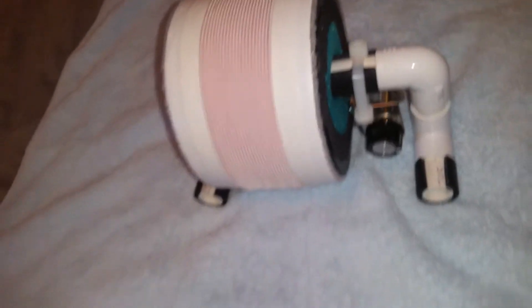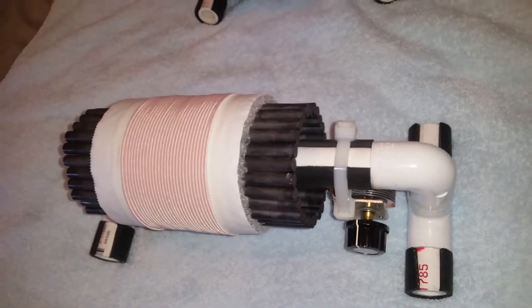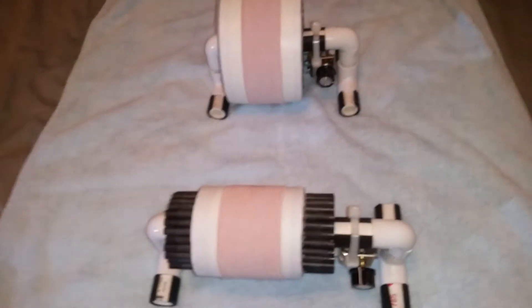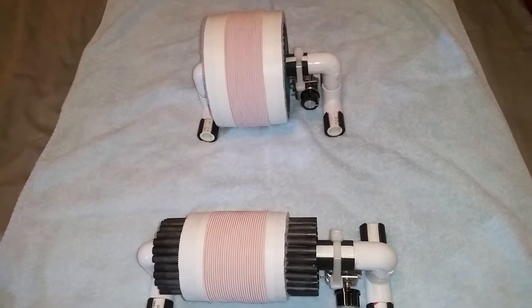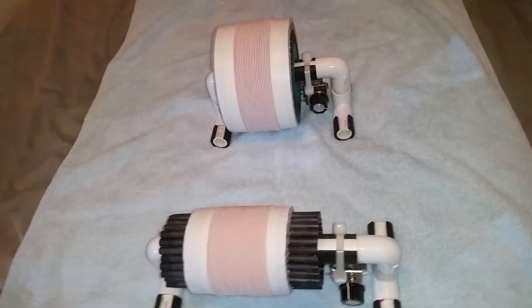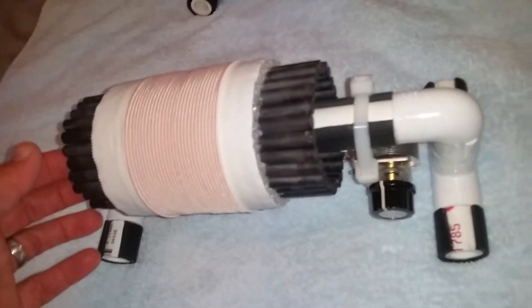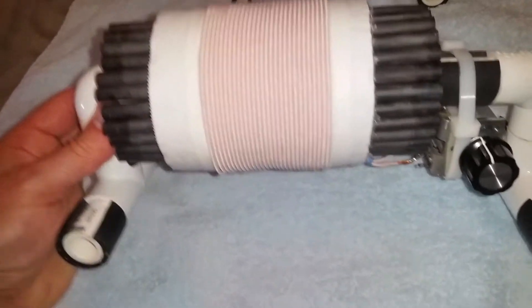So as much as I would like to make more of these, I don't have enough stock to provide those bars for a lot of new FSL antennas. I've had to design a replacement that anyone can make using readily available parts. This new Baby FSL model, even though it's a smaller diameter, has longer ferrite rods. The ferrite is longer, so according to the FSL sensitivity design formula, both antennas are exactly equal in medium-wave sensitivity. The 27 rods are currently available on eBay for about $71 shipped to the USA.